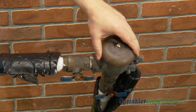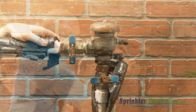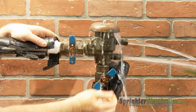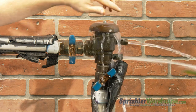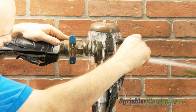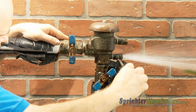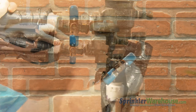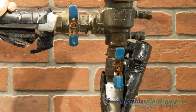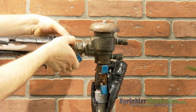When you're done, you should be able to turn the bell. We're going to close the outflow valve. Open the inflow valve halfway — that's a 45 degree angle. Water will be spewing out of the test cocks. Close the test cocks — that means turning these slots so that they're vertical. Open the inflow valve slowly all the way open; the handle should be fully up and down now. And slowly open the outflow valve so that the handle's horizontal.